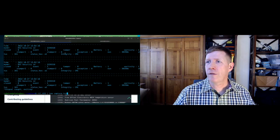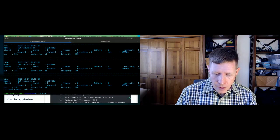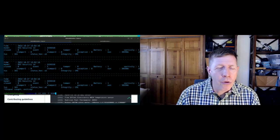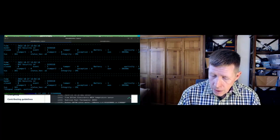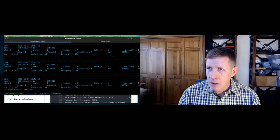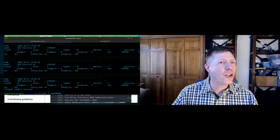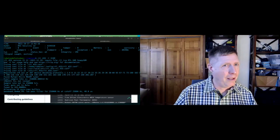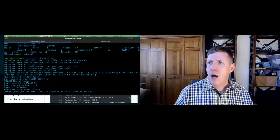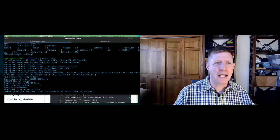It also works on other frequencies. So if I want to say RTL-433 -f 315M, so 315 megahertz, or I could do 315,000,000. But it's easier just to say 315M. And now it will tune. You'll actually see it tunes to 315 megahertz. You'll get a completely different set of devices. It's so cool, and it does all of the same things. You can also run it on 868. I've run it on 868. I've run it on 345. Didn't find anything around me.